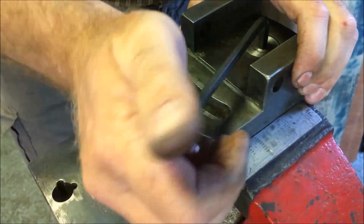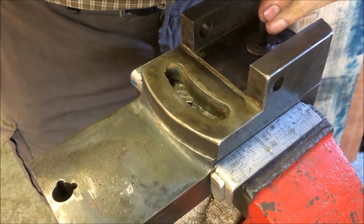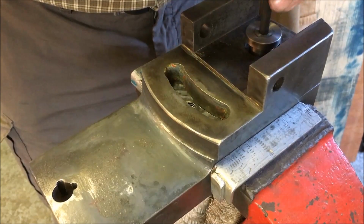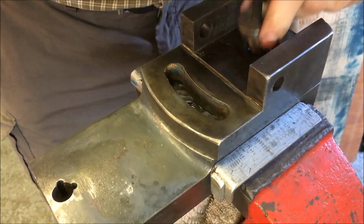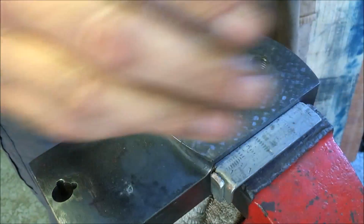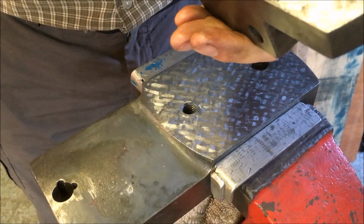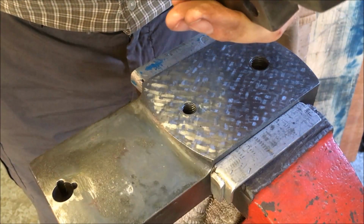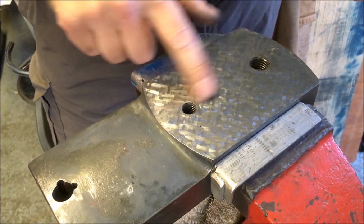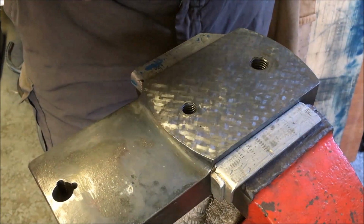But what I'm going to do is now just take it off the underside of the clapper box housing. So I'm just going to go over this area now, just to keep taking the high spots off and get it so it seats a bit better. It's not a million miles off, so yeah, time well spent.